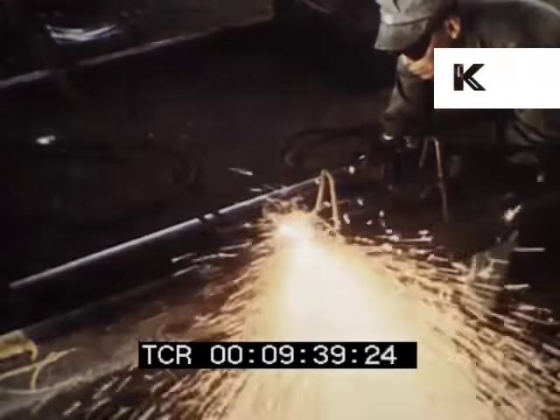A 315 cubic foot track-mounted air compressor powers the four pneumatic spike drivers, each operator having a spare man to relieve him at specified intervals. Distributed from a trailer, two rail anchors are placed at every other tie. Our anchoring pattern is termed box anchoring — rail anchors are applied on each side of alternate ties, so that each alternate tie is boxed between two anchors.